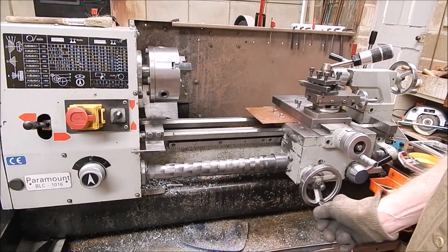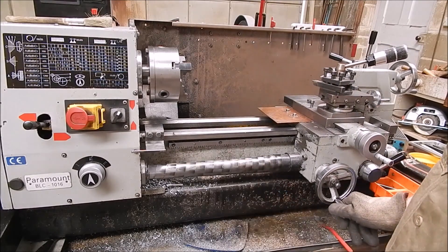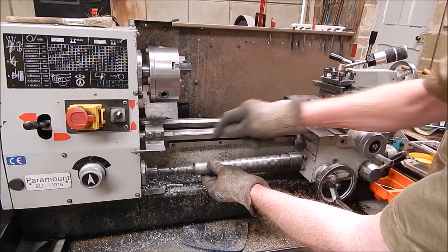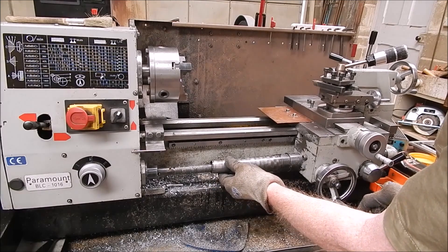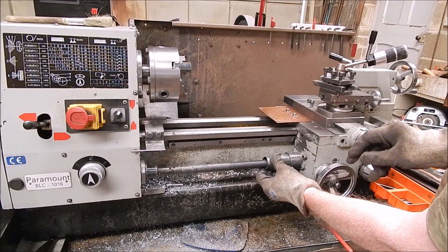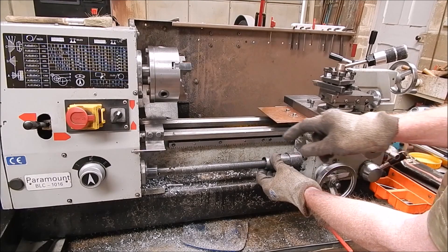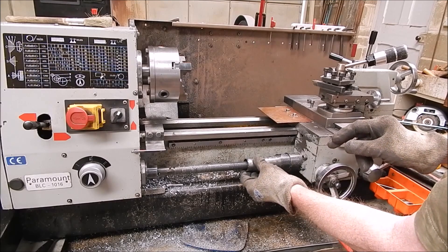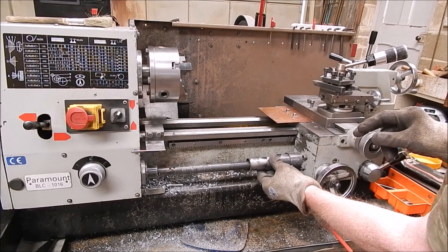Just knock out the pin and put in a bit of brazing rod. I fixed it this morning and I'll show you — there it is, that's the pin I was replacing. And I thought to myself, I haven't lubed this lead screw for like five years. Have a look at it — it looks like it's still got good coverage there. I use this stuff, which is a Loctite-type product, and I thought I better do it again; it hasn't been done for quite a while.